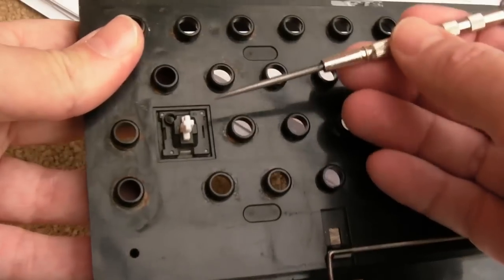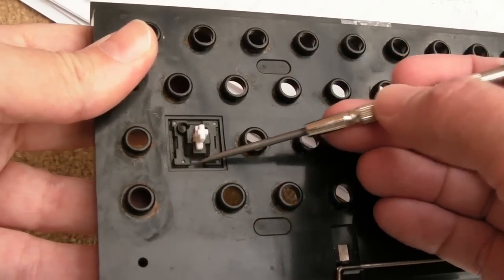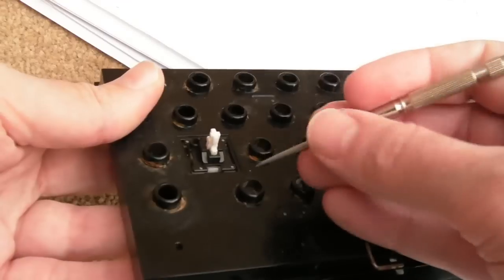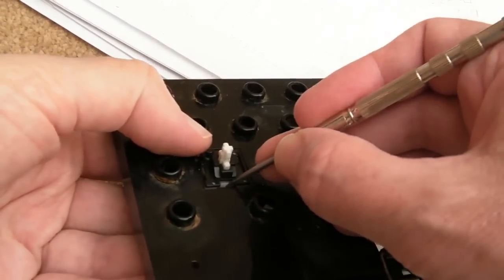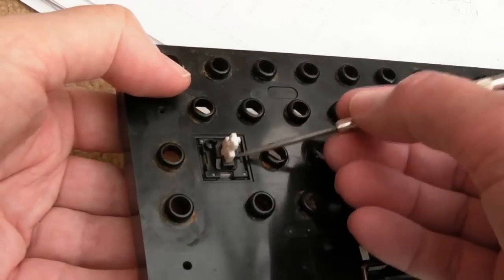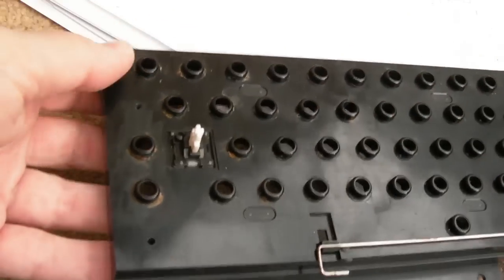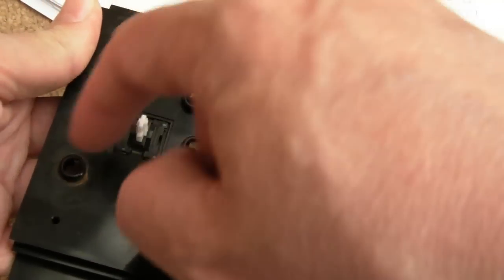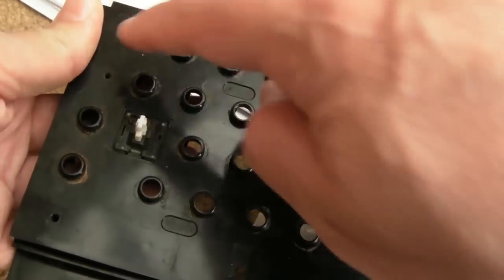Yeah, there's two components to this. There's like a black piece of plastic here that clips on the top. Yeah, and that probably holds it in so it stays in. But then you've got those two clips. So, yeah, you can't just get it out by pushing those clips like that. You need to unclip this top piece here somehow, I think. I don't want to damage it, so I'm just going to scrub all around there, leave this bit, and then clean this bit here with IPA and cotton buds afterwards.